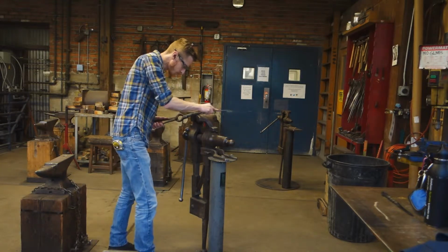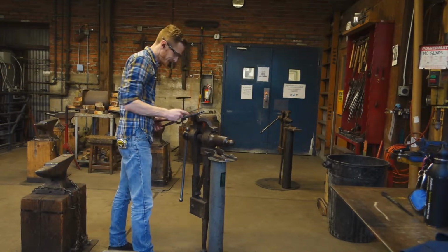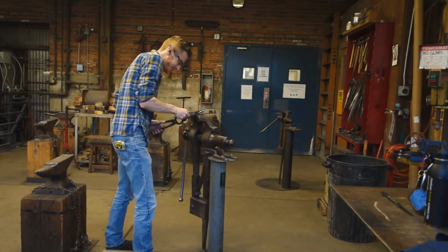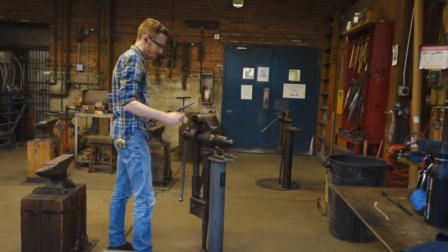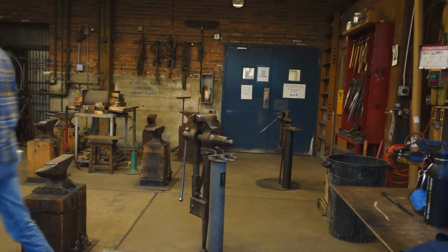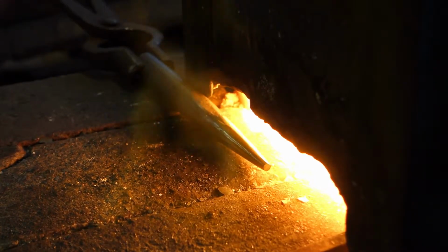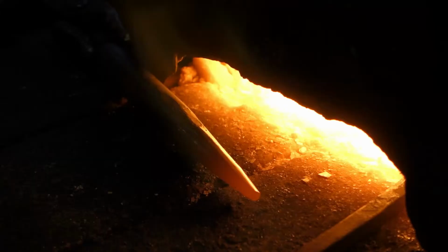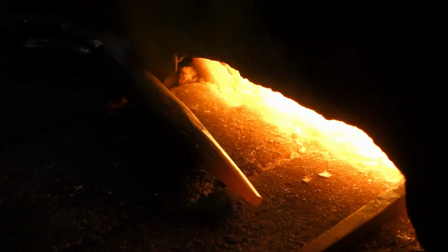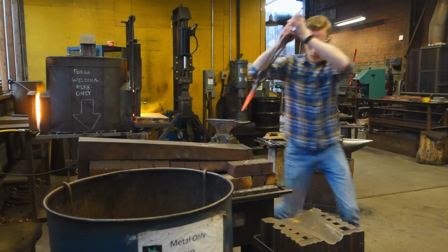The file should skate right off of it like it was skating off of glass and have a very high pitch as it moves across the metal. If the file bites into the hole punch, like leaving a good gouge and taking out metal, then you know that the hardening didn't work. This means we need to go back to the first step of the heat treatment process. Normalize the metal, let it cool down, then we need to heat it back up and do another hardening attempt.